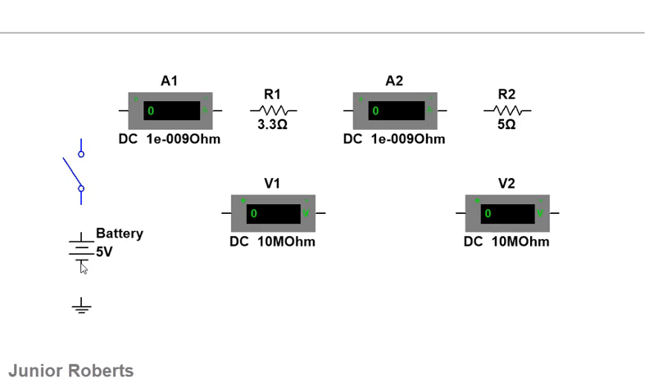If you're using a battery pack or a DC power source, the positive terminal is indicated by a red terminal. We need to ensure the positive is connected to the positive side and the negative is connected to the negative side. Even though there are components in between, we follow the same rule — positive to positive and negative to negative — when connecting our ammeters.